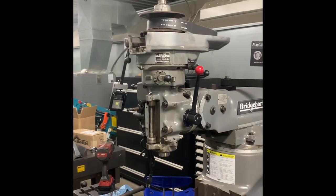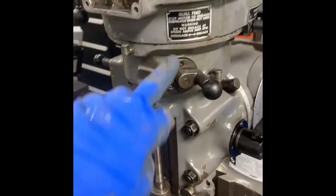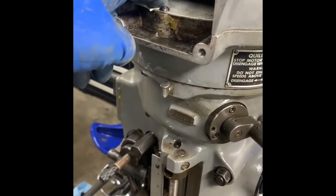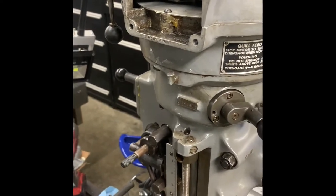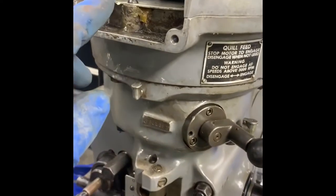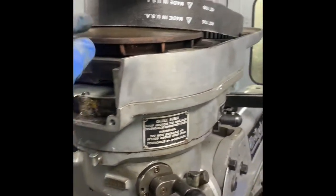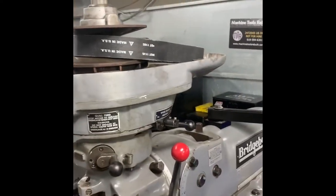The lower housing is all finished and trimmed up. The transmission housing — the plate comes off, all the grease gets taken out, and it gets packed with new grease. In this case there were some problems with the high-low handle, so I had to replace some parts. It has a new brake shoe set and new brake springs, because those have a tendency to break — no pun intended. Now we've got bushings and keys in the upper end, a new belt, and we're going to go up from there.